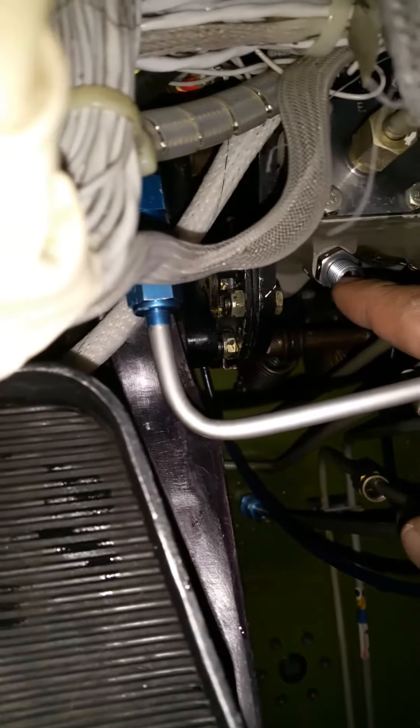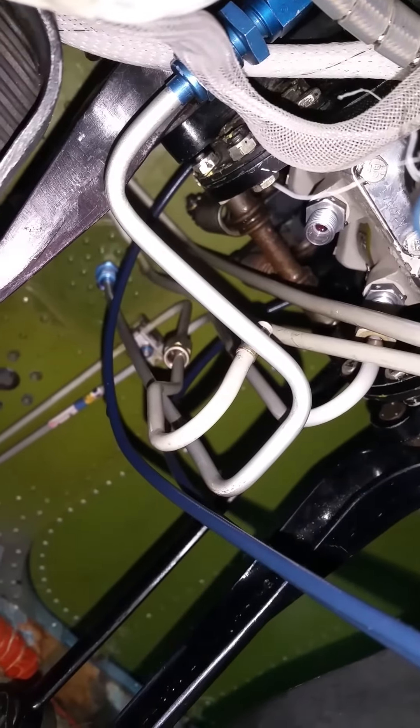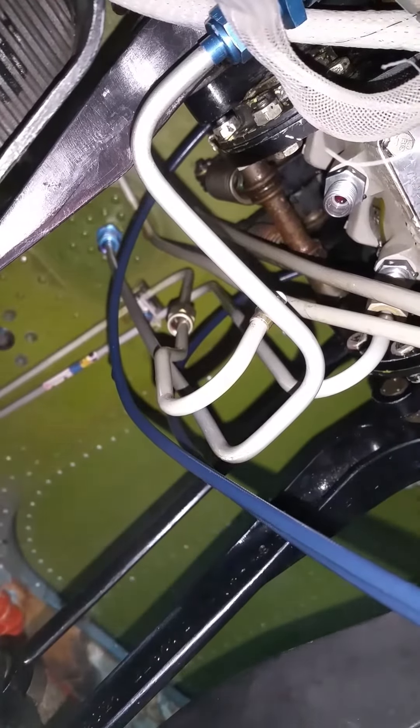With this line off, if I push the left brake pedal all the way to the stop, there's no fluid coming out — absolutely nothing. Without brake fluid coming out of that port, it can't pressurize the brake distributor valve for emergency brakes, and that's why you have no brake pressure on the left side. I did take off the right side and verify that if you push the right pedal, you do get fluid coming out, but there's definitely no brake fluid coming out of the left port.